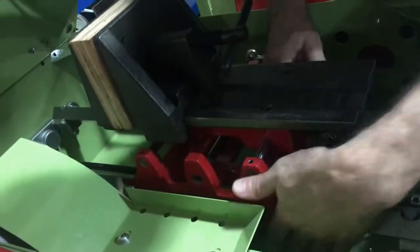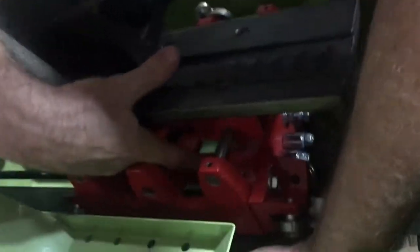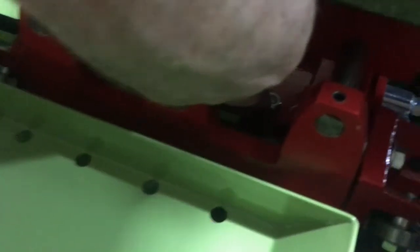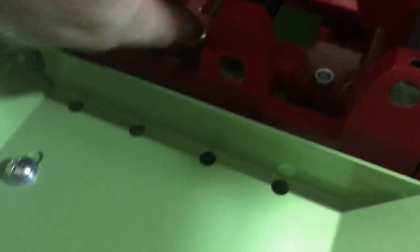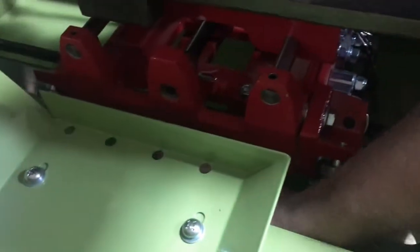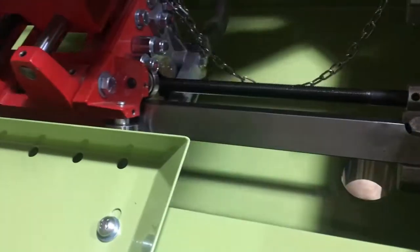There are four bolts here. The ones that hold the carriage retainers on are threaded into the carriage body, and then there's a nut on the top that locks that bolt in. You'll start by removing that nut — there are four of them, two on each side — and then the bolt can unscrew from underneath, and those carriage retainers will come off and the whole carriage is then floating.